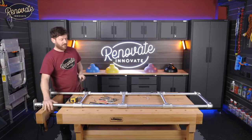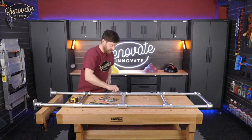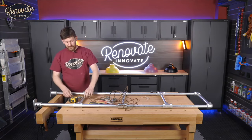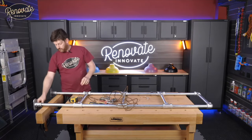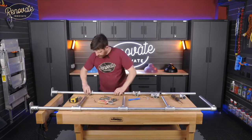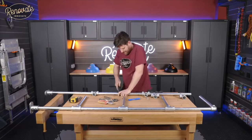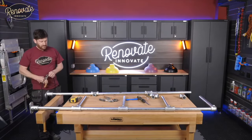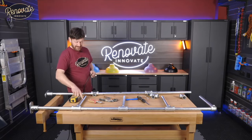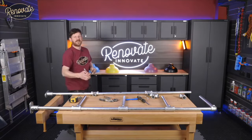We've got our frame pre-assembled. Now I'm going to take one side apart ready for wiring, mark up all the brackets so we know where to put them back, and get it wired up. We'll use this fancy rope flex for the lamps and run twin-and-earth cable up through the leg. We'll cut the cables to length for each one and daisy-chain the cable from the first one up to the next, then the next, and up to the last one.